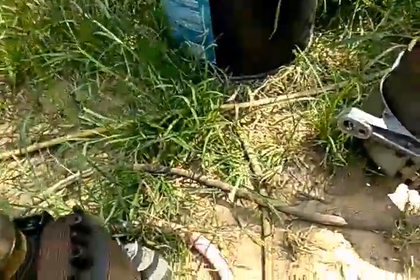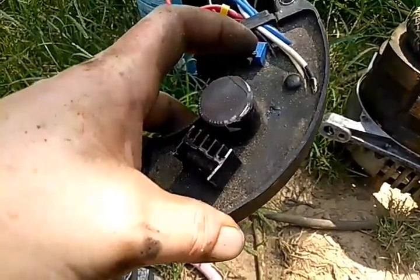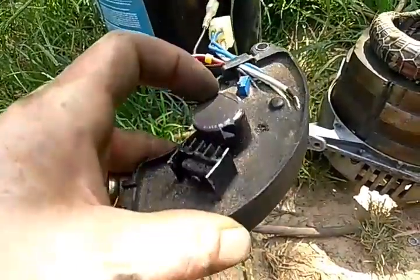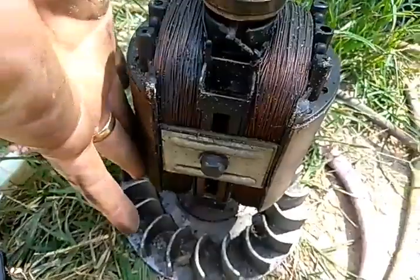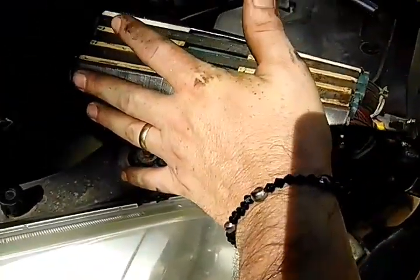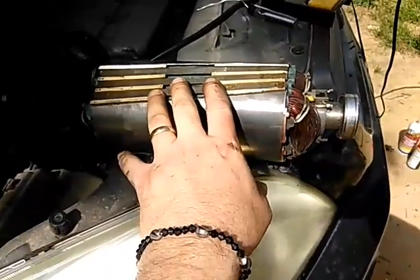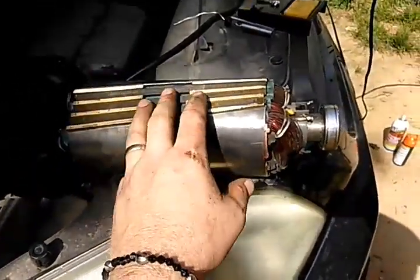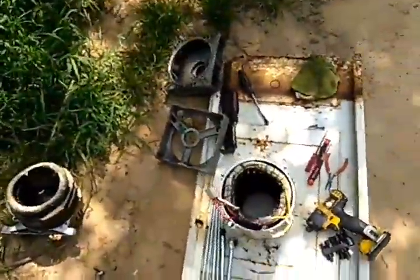AVR — we've got a capacitor. We've got a little dial here that can control the capacitance and allow you to raise or lower your voltage. This right here is basically how much charge it can hold, and it's about as long as my fingers. That's a 4,000-watt generator head. Now this one is literally more than twice the size of the other one — and this is a better type of three-phase generator, a self-excited generator head.